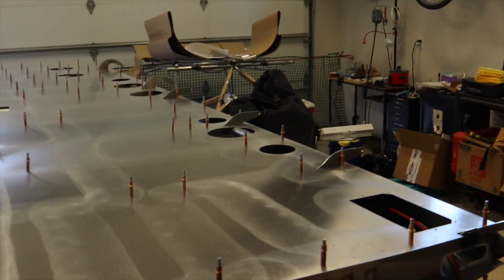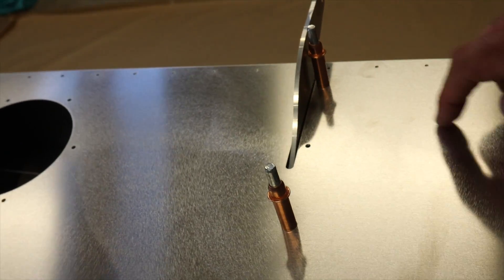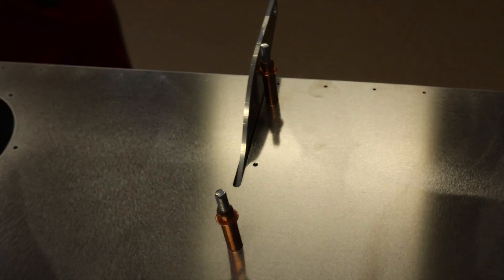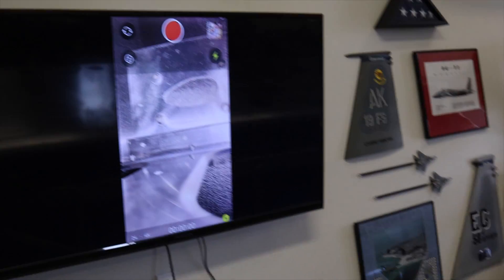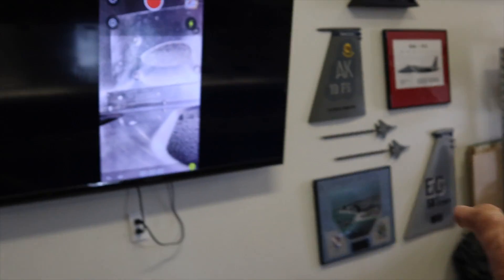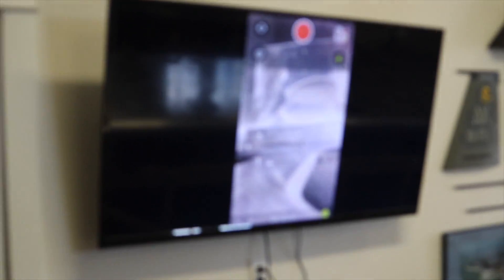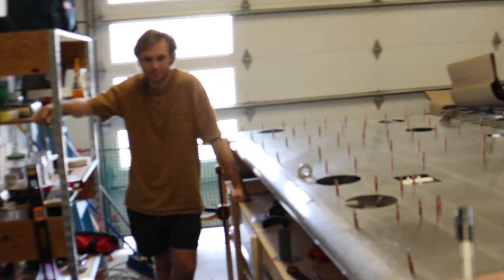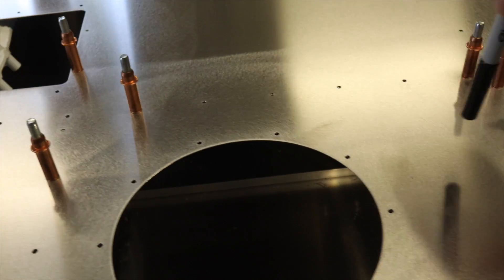We have the skin test fit for two reasons. Number one is we want to ensure that there's ample margin between the hinges and the skin — if not, when we take off the skin, I'll file them down, so we're going to mark those. And number two, I've got my cell phone in that inspection hole, AirPlaying to my Apple TV right there, so that we can use the felt tip marker and mark all the holes for the pitot installation, which is taped in place right here.